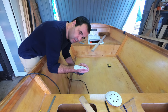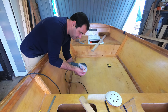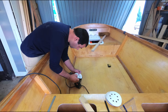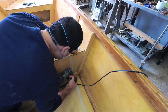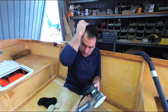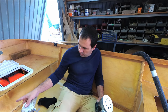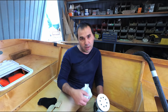I'm going to start with 120 grit; if it's not enough I'll go down to 80, but I should be okay. I don't really need to go all the way to the wood - I just need to get rid of the varnish. The 120 grit was enough; it removed all the varnish no problem whatsoever. In some areas it actually went to the wood which I didn't want, but it's not serious as it's going to be under the glue area.